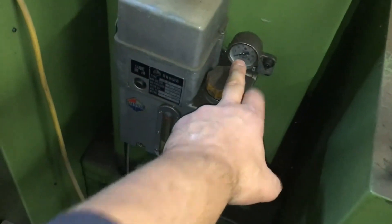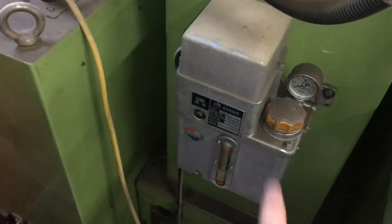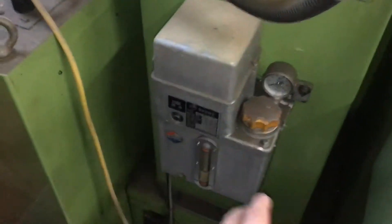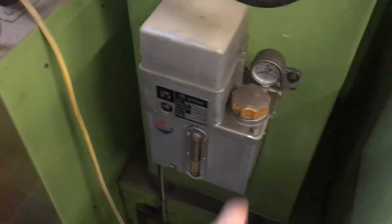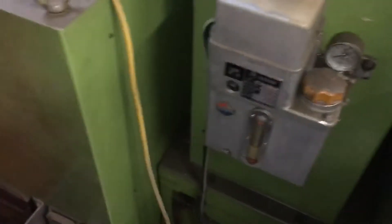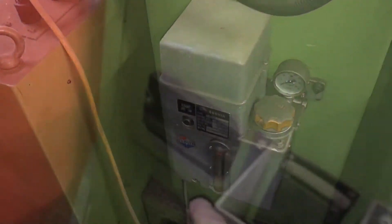Right here is the way lube pump — this is not based on spindle time, it's just based on machine-on time. So you could leave your machine on all night and it'll just keep pumping way oil. Normal way oil is what I've put in here.